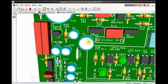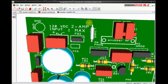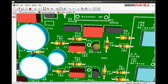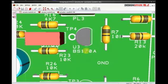But I have to supplement that energy from an external source, which is a Chinese thing, which I'm going to connect to this. So I've got a socket at the top there, where I put my 120 volts input into the board, which is what supplements the actual circuit, which is an H-bridge, which I found online, and I drew it up, and I've got my BS170 MOSFET driver.